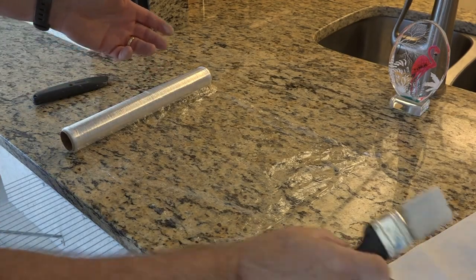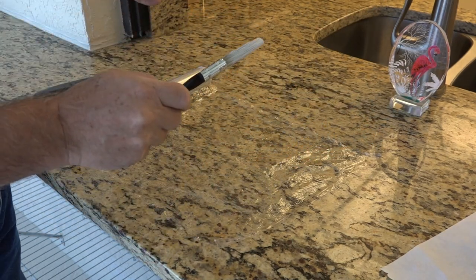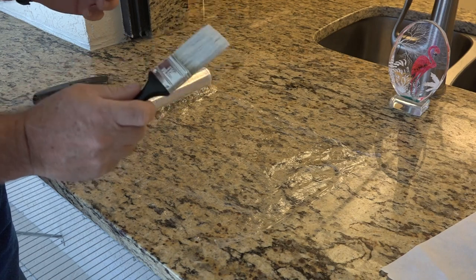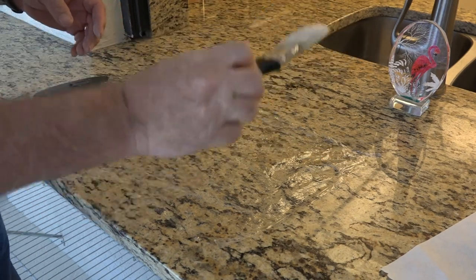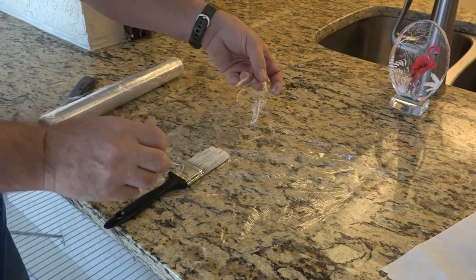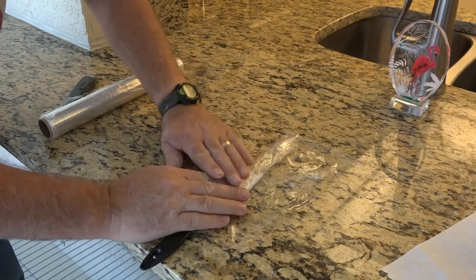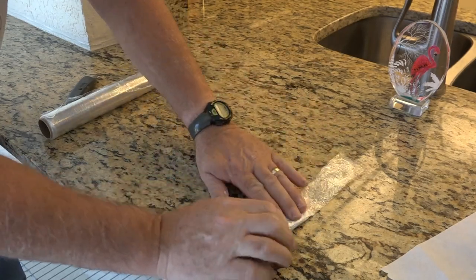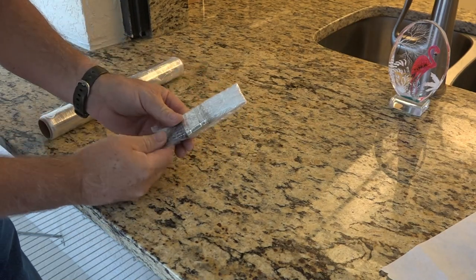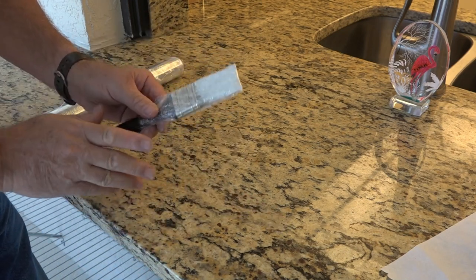When you're using any kind of polyurethane or oil-based paint and you're doing multiple coats with a couple of hours in between, what do you do with your paintbrush? I don't clean it out completely. I wipe out as much paint as I can, then I get some saran wrap, get all the air out, and wrap it up. That will keep the paintbrush from drying out for at least two or three hours while you're waiting for the first coat to dry — then you just take it off and keep going without having to clean it.